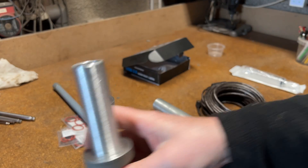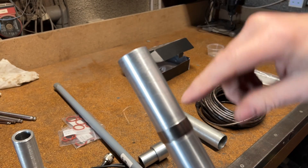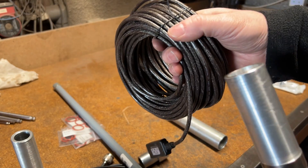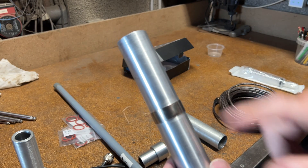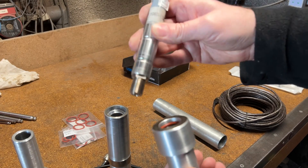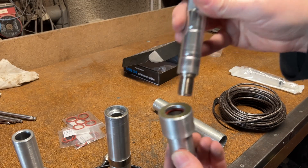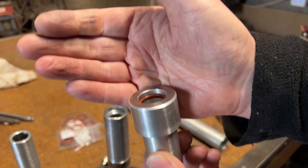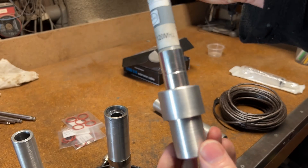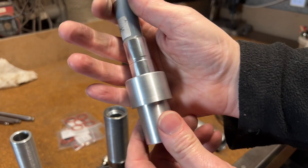I did those off-shot and didn't bother video recording those. What I am going to do now though is another adapter — that's to get the cable out of the tube, because the plan is an active USB cable is going to run down the center of the tube, pop out the side, and go off to the Raspberry Pi. I made an adapter to go on top of the mast and another adapter for the antenna to fit into. This is only a 60 centimeter antenna. I've got a 1.2 meter ready to go in. There's an O-ring groove and an O-ring already cut in there.